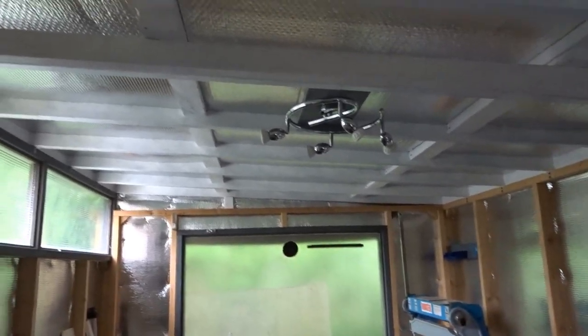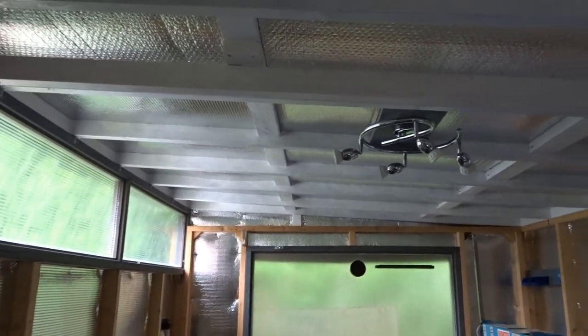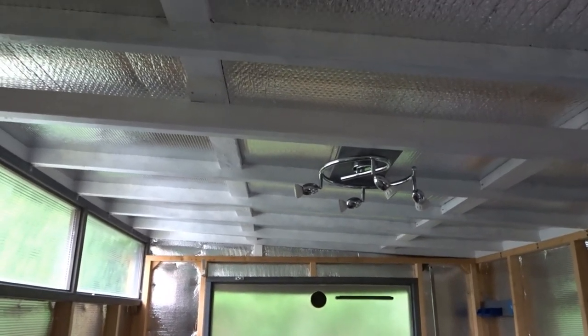Because it's 8 feet wide, I wanted an overhang at the front and an overhang at the back, which I'll show you in a moment on the outside, so I had to purchase 9-foot lengths of 2x3.